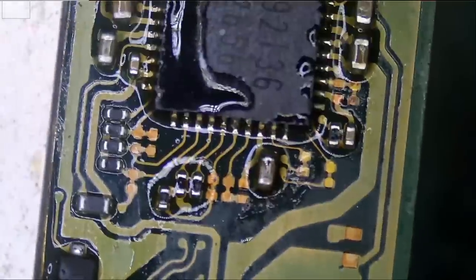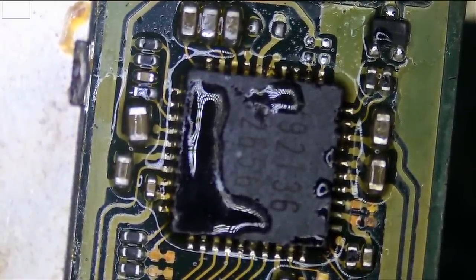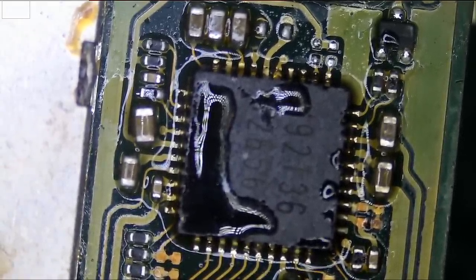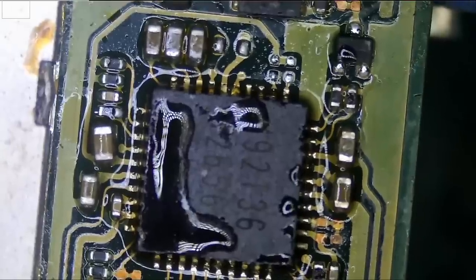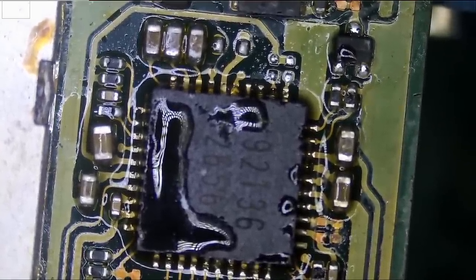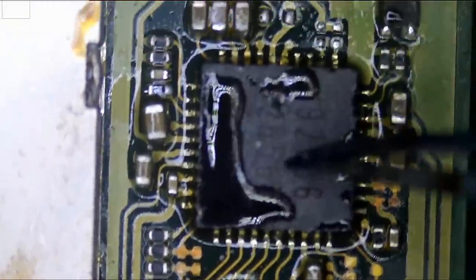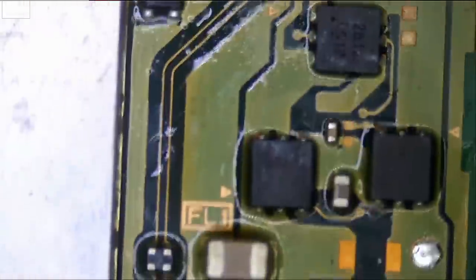It's good — and look at what we have here. We're going to have to go over this chip; we do not know how the soldering is. I see three missing components — one, two, and three. So we're going to go over the chip and put those three components back on from a donor board that we have, and let's continue with the inspection to see if there's anything else.